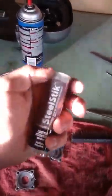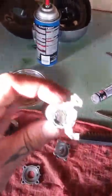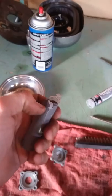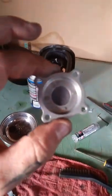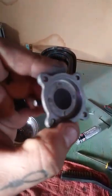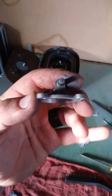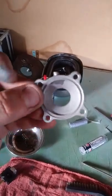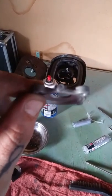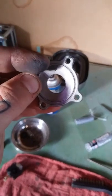This stuff here is real simple, real easy to use - just a two-part mixture. Cut off a little bit; you don't need a lot. Knead it together until it's one color. We packed that through full - that little hole is now plugged, got that all full in there. Same thing with this one: packed it in there. I filled that little hole all the way until you start seeing it come up, then packed the bottom full. But you don't want to go over that lip.